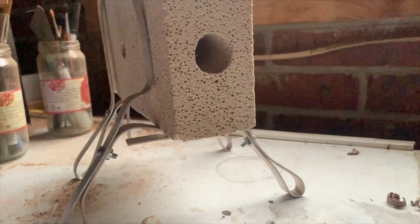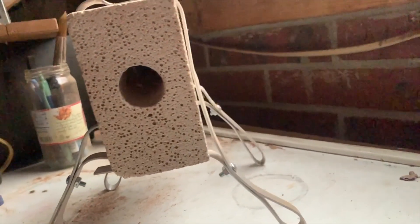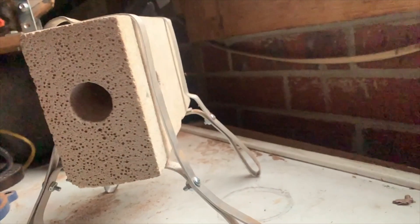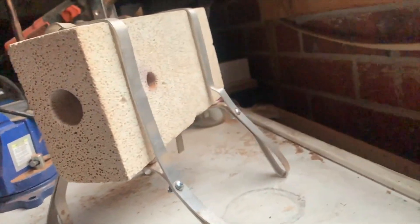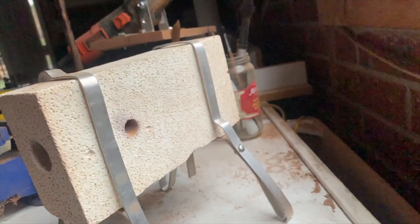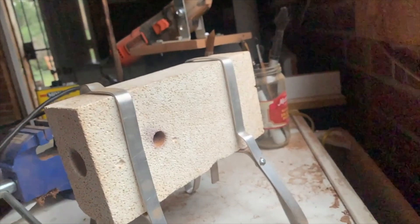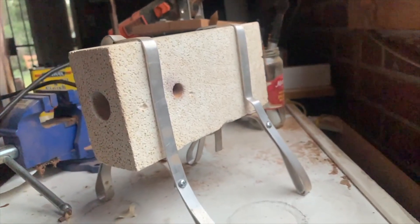Here's one more look at the forge. There's one hole at the back facing towards the chamber at the front, and then the one on the right is angled towards the back — so there's a kind of cyclone thing happening. We're not worried about crazy shapes or dynamics; we just want airflow in there and to have a little bit of balanced heat.